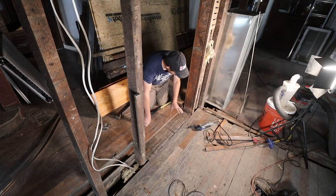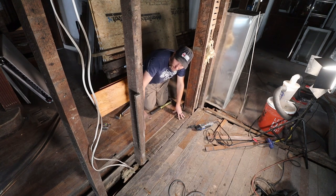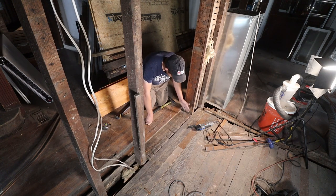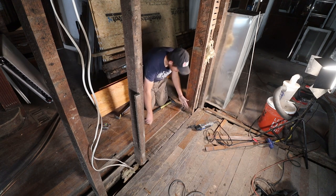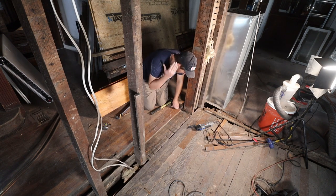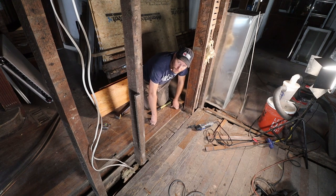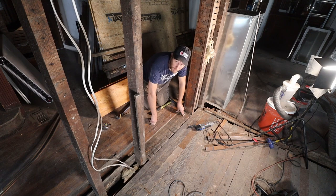As I'm prepping here for a beam, or really a wall first, I'm going to finish this wall here. According to the specs that we calculated yesterday, we have to put 6 inches worth of support underneath there. The support is supposed to go all the way from the top, so wherever you put the beam, whether it's on the second floor or the first floor, it's supposed to be supported in a continuous way from the top, where the beam is, to the basement floor.